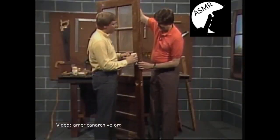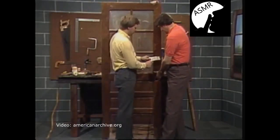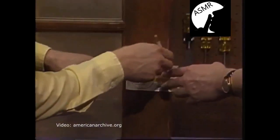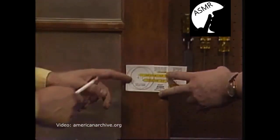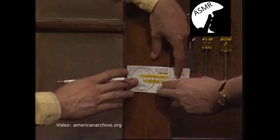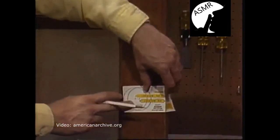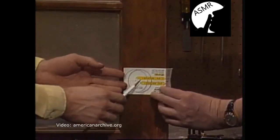The backset determines the distance from the front of the door to where the plunger will go. To use the template, there's a dotted line — you fold it along that dotted line and place it on the door where you're going to put your lock. Hold it in place. The guide for drilling is already set for you. If you're ever not sure, you can hold your template up to your other existing hole and determine which ring is the appropriate one.